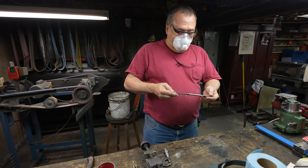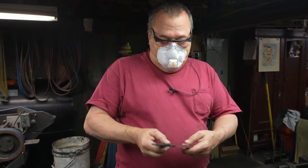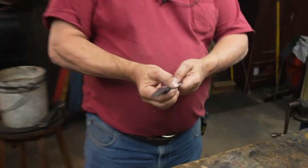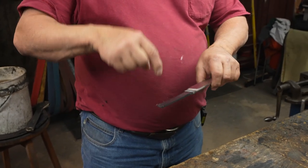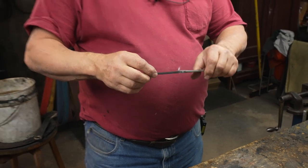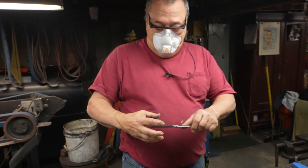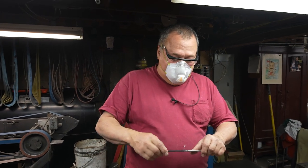We've taken the blade that's been ground to 110 grit, and we've blued the tang down halfway down the Ricasso, keeping this cool. And now this is softened enough so that later on when I go to drill a hole in it, I'll have no problems. Otherwise, it's really a disaster when you got a piece of wood mounted to it and you're trying to put a hole through it, and the drill bit skids and it damages your wood.